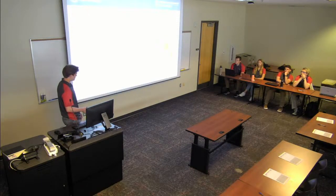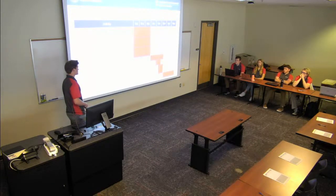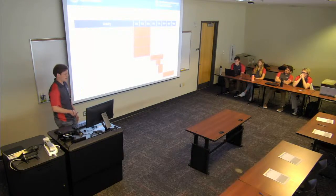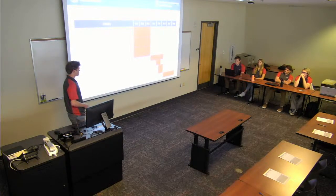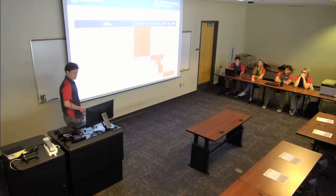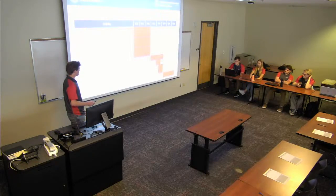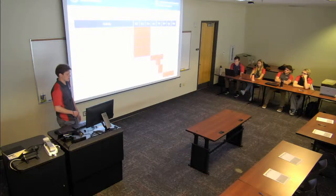Plan for the year. I actually think this is a redundant slide, so I'm going to go here. So researching the motor improvements, casing size, composition, nozzle dimensions, that'll take place from now until December, as will reestablishing contact with the Aerospace Research Center for the 54 millimeter motor testing. And right now we're also running through all of our preliminary simulations and getting ready for testing. And by the end of March, we want to have our motor design finalized completely, including hardware ordered.